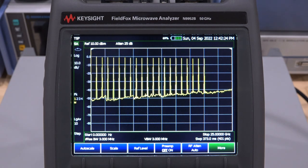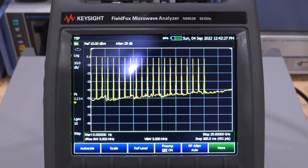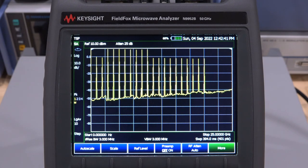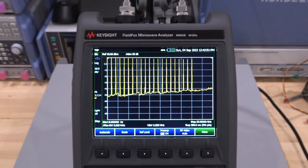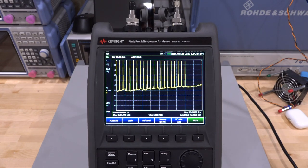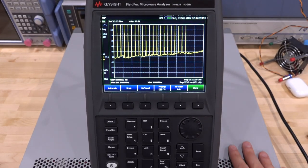Let's go to 10 GHz and increase the amplitude. We can do 10 dBm. Now we should be able to cover the top of those traces — and there you go, that's 10 dBm. It works all the way to the end. I'm really happy about that. This was very stressful because I didn't want to disappoint the Keysight engineers who went out of their way to send me that part.